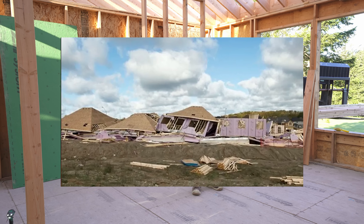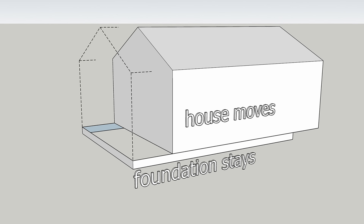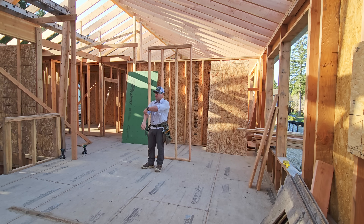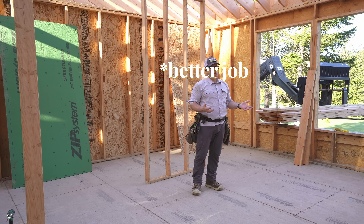We're trying to prevent racking. Second, we're trying to prevent base shear. And third, overturning. So let me just show you what each of those does. This is very introductory, but I think as framers, if we understand this stuff a little bit better, then maybe we do a little better job with the workmanship.